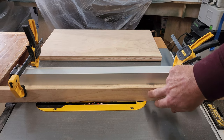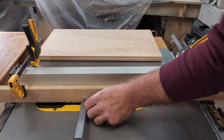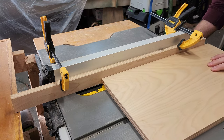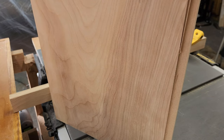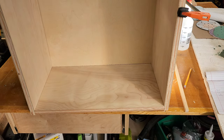I have a temporary fence set up so I don't cut my real fence. With the double square set at the same thickness as the back panel, I can use that to measure how thick I want the dado to be in the bottom piece. That way when I slide the bottom piece into the dados I already cut into the side, it all fits together into a nice square box.